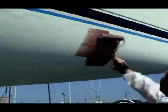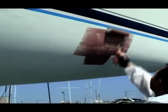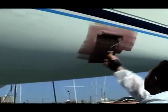As you can see, this demonstration yacht is being painted in good weather conditions — dry and breezy with the temperature in the low 20s. In these conditions, the entire treatment will be applied within just a few short hours. Coppercoat should always be applied immediately after mixing, while the epoxy is at its most fresh and fluid. Under usual circumstances, the product should be applied with short pile, preferably simulated mohair rollers. Under no circumstances should you attempt to use long hair rollers or brushes.